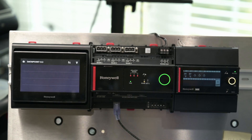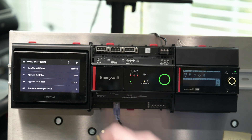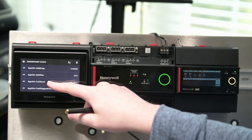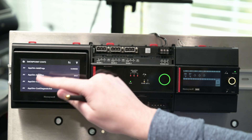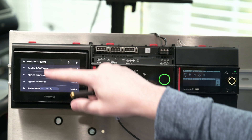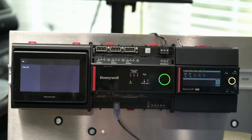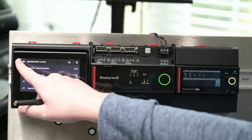Then we've got our data point list. This is configurable from within Niagara — you can control what kind of points you want to show up on this list. Right now I basically have it set to show all control points, so there are a lot of points showing up here. With the display, you can do the typical scrolling action — you just have to be quick in order for it to register scrolling to the next page. Tap in the middle and swipe up quickly, and you can see I'm going through each of these pages with our points. You can tap into a point and see the data and make changes if you need to.